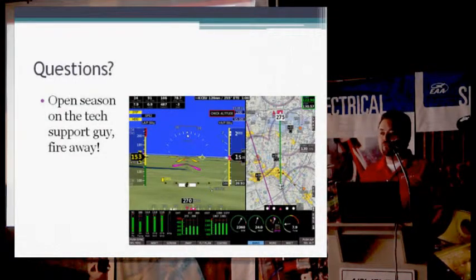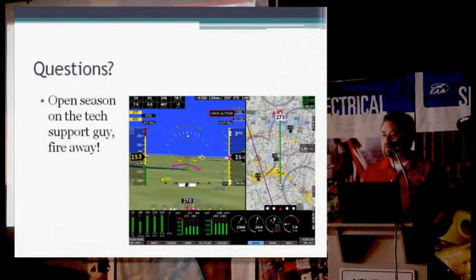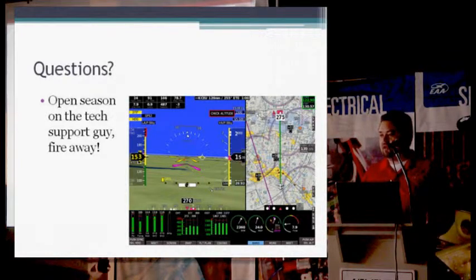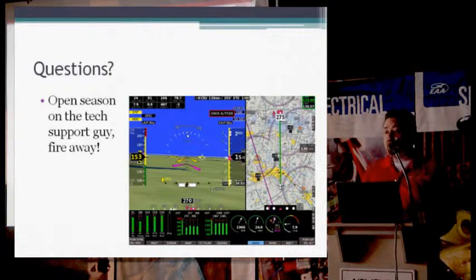The first thing is movement. When the magnetometer is being aligned, just after boot up, if it's a windy day with the RVs, they've got those really springy gear, if the airplane's rocking from side to side, that makes it take longer because it has that slight variation in what it's seeing. It takes longer for it to align. If it's a calm day, it probably takes less time because the airplane's not bouncing around. So movement plays a big factor into that alignment timing.